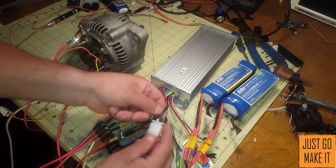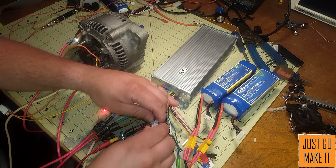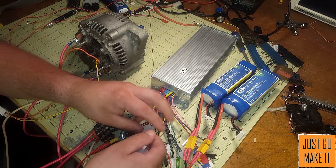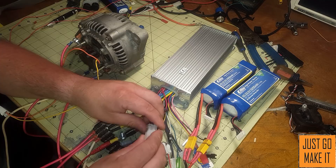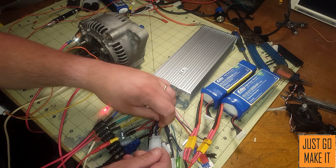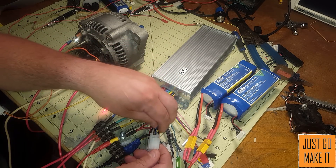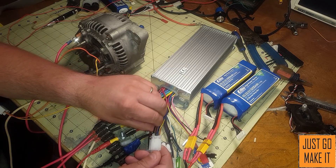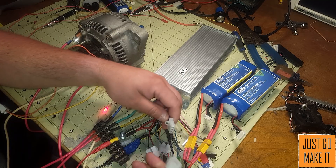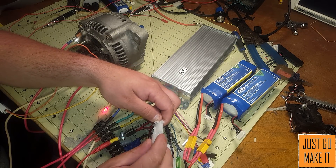Mine has a plug with three wires: blue, brown, and black. All the black wires are ground. This is a speed select — with the black and blue jumped together that's high speed, brown and black jumped together is low speed, and with no jumpers on any of the wires that's a mid speed. I'll be running it at high speed for now.